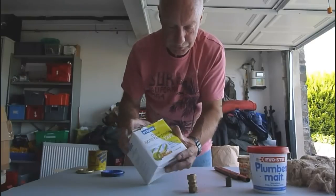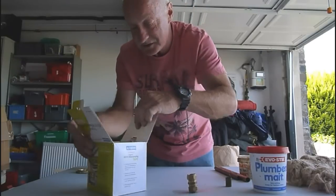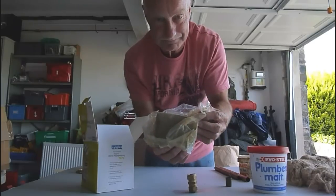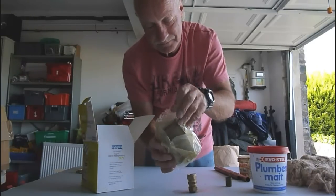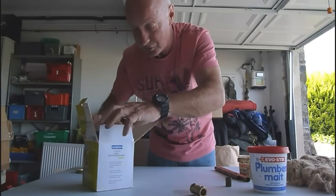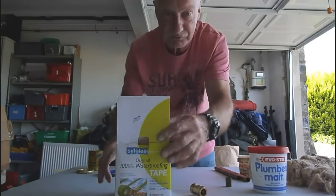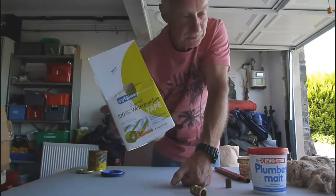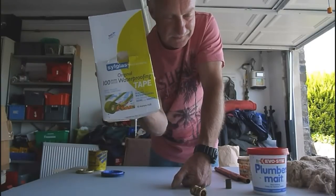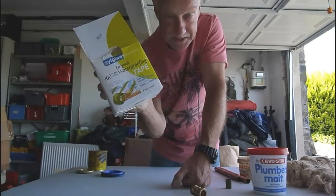That leads me to my very last thing — and that's this stuff here. It's called Silglass — it's a waterproof tape. This is a real get-out-of-jail item. This stuff sticks like crazy — honestly. You need gloves, and you've got to unroll it and wrap it around. What I use it for is emergency leaks, mainly on soil pipes. If you get a soil stack leak on one of the joints, you can wind this Silglass round and it will hold for quite some time. In fact, I've actually gone to joints where it's had this stuff on for about five years and it's just started leaking through. It is very, very good, but it has got its specific uses. I don't think it holds mains pressure — not very good for that. But if you want to seal a soil pipe leak or a waste pipe leak and you can get this stuff right around it, it works well.